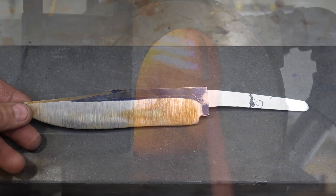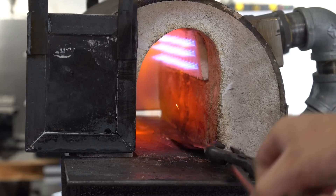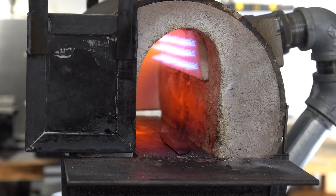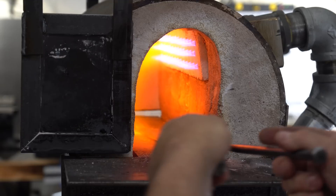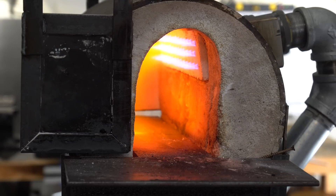We are ready to do some heat treating. We're going to start by normalizing the steel. Since we've done a bunch of forging on it, we want it to relax. I'm heating up the forge right now and then we're going to put in the steel and get it up past magnetic, then give it a couple more minutes to get a nice orangey color. I've got the forge turned way down — I want to hold the knife in here at this temp and give it a good soak. You'll notice I put it in tang first, because there's more mass in the tang than the tip. If you put it in tip first, you're going to overheat the tip. I use a magnet to check the temp — it'll lose its magnetism at 1425°F, then you go a little past that, up to around 1600°F for normalization. At the end, I just clamp it by the tang and let it hang to cool.